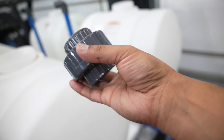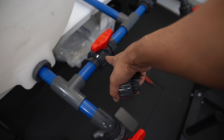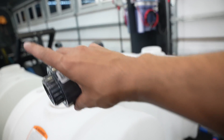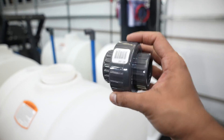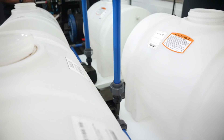These unions — you can put them wherever you want a joint. It's good to have unions because you can take things apart anywhere without messing anything up. Technically you don't need them where the ball valves are since those already have slip-fit connections, but wherever else you want one, that's what they're for.